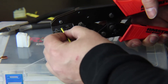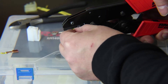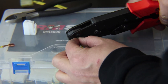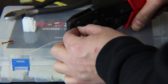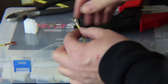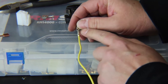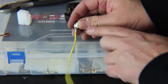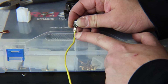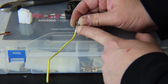I'm going to insert my wire into the terminal, making sure that the insulation is sitting just inside the back of the terminal, then crimp down with the tool and let go — it'll release. I cut my wire a little too long, but that's okay; it should be a little shorter so it doesn't stick up into the terminal. You can see the back crimp is folded over onto the insulation to lock it in place, and the front crimp is folded over onto the wire, making a good solid connection.